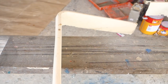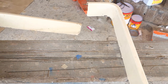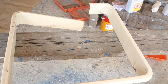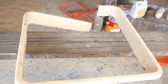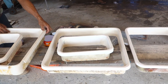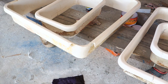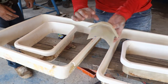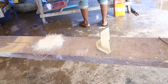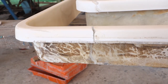Nobody knows exactly how this broke, but it broke here. According to Un it's very simple to mend — it'll be glassed, epoxied back together, sanded, fitted to make sure it's the right fit, then resprayed and put back in the cabin. Originally we decided to leave the hatch surrounds inside the boat, but we changed our minds — it's much easier to bring them outside. Moo has made a mold for that broken piece using microfibre, biaxial cloth, and epoxy. When it dries it comes out and goes in. There are a few cracks in them, so it's a good thing they took them out. They've been sanding them back, cleaning them off, and smoothing them out.